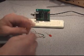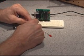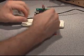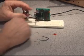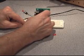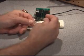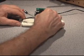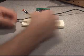So we'll start by connecting the power, and in this case the ground is going to go to pin 2, and we're going to put our positive voltage in on pin 3. The reset switch connects between pin 4 on this Basic Stamp OEM module and ground, which will be the bottom bus here. Now let's make that ground, so we'll connect from our power supply ground a jumper lead down to this ground bus. Then our transmitter, which is actually an LED in this case, goes from pin 5 to ground. And we put our resistor in series with our ground lead.